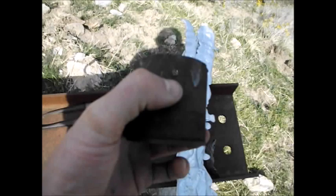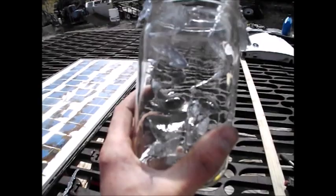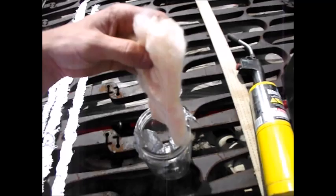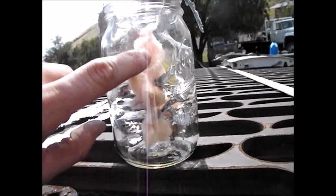You can see on this can there's a little hole. I'll melt some lead in here, and then pour it out through that hole - that'll get me some nice little strips of lead to use in those jars. Here are the lead sheets I made. See, they're incredibly thin and they have a rough texture - that'll give them lots of surface area for the reactions to occur on. I've taken them and folded them up inside this jar. Now, as long as they're not touching, you should be fine. As long as there's no metal-metal contact, you won't have any shorting out.